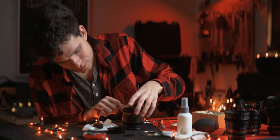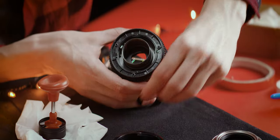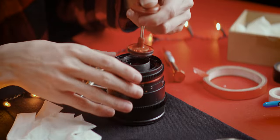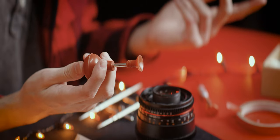With the stack of elements out of the way, you can get a clean view of the aperture and place the oval insert right there, aligning it by eye with the lens markings. Once the oval is in position, you can rotate it using the lens wrench or your screwdriver. Put the elements and the locking ring back into place. The glasses and spacer can get slightly jammed depending on their angle of insertion, so I recommend putting them back one at a time as straight down as you can. If they get stuck, free them with a little encouragement from the lens wrench on the side that's higher or tilted. Or if you're using the suction tool, you don't even have to worry about that.